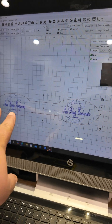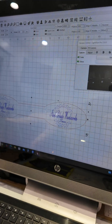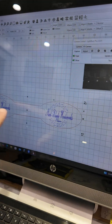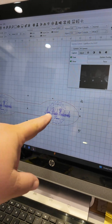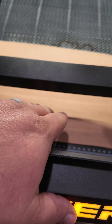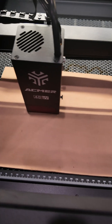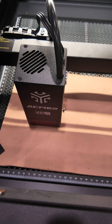As you can see here, we did a quick little setup. I'm going to do my logo — the outer part is the actual keychain, the leather part — and we're going to engrave the logo and then cut the red line. There are the settings. We have the leather set up and the laser focused on the leather. I'm going to go ahead and hit frame, and you'll see it frame out. Then I'm going to get this machine back to its home position, turn on the air purifier, shut the lid, and we're ready to go.